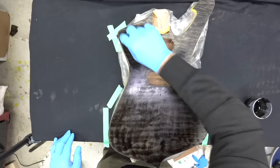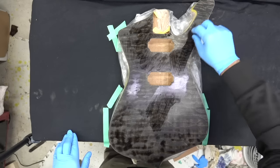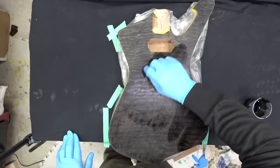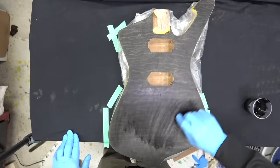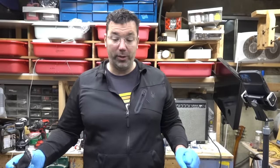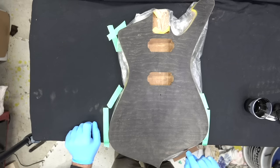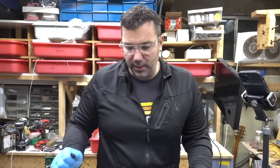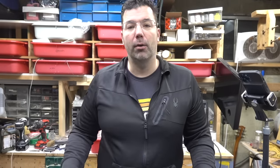You can see this is not just total black — it's got enough brown in there that this should really help. So that's three coats, soaking in pretty good. A little splotch in a couple spots — had a little bit of run out right there so it'll show up darker. Not sure if I'm going to do a bursted edge or if I'm just going to stain it and leave it. We're going to let this dry for 24 hours, sand it off, and come back and finish this up.